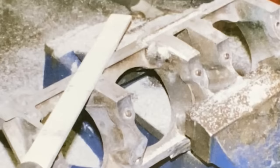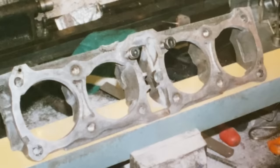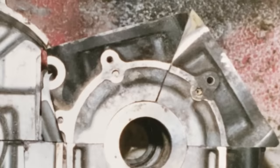This was a critical part of the job. I had to cut this section out and it had to fit perfect and I had to get it right first time otherwise I'd need to use another set of crankcases. But after lots of filing I eventually got it onto some sandpaper glued onto a bit of wood and lapped it backwards and forwards for hours until it fitted perfect. It was like a three-dimensional puzzle keeping these two parts in line when I was lapping them to get them parallel, square and true, but eventually they all fitted perfect and there was barely any gaps, so I was now ready for welding.